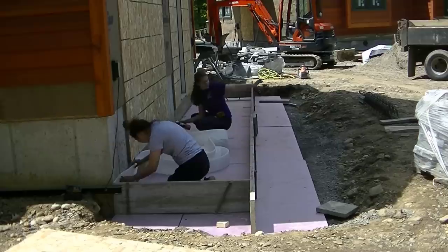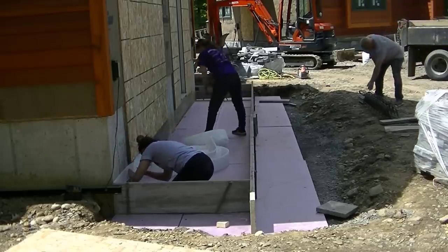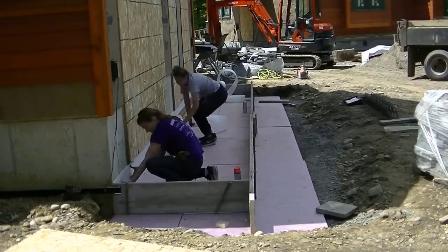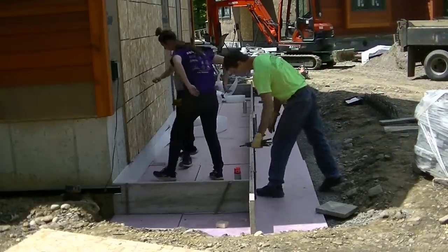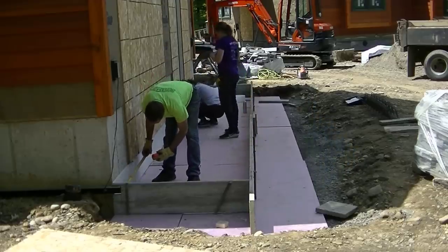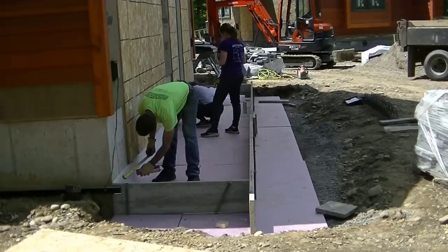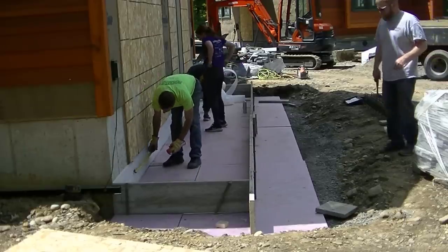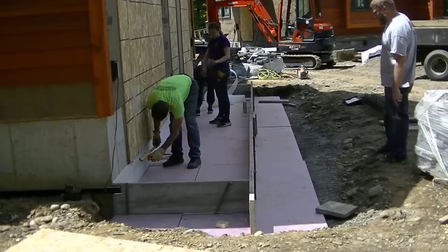What we're doing now is Tee and Abby are gluing up what we call iso strip — it's an isolation foam that keeps the concrete apron from bonding to the foundation of the garage, just in case there's ever a little bit of movement so one's not going to damage the other. It's about a half-inch wide piece of foam and you can buy it in four-inch, six-inch, or eight-inch widths. We didn't have any twelve-inch so we put up two six-inch pieces.